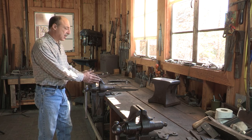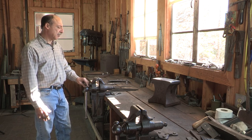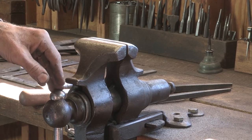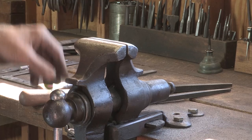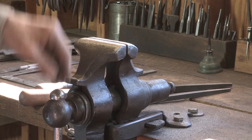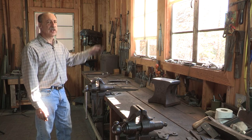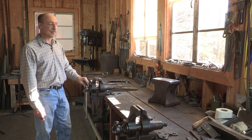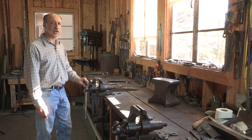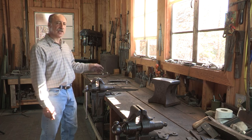I've got the vice set up to take advantage of all that incoming light from the windows. Many historic shops are set up so that the windows face north, which gives you the most even light through the course of the day. I wasn't able to do that here — my windows face south, which often gives me too much light, so I need shades on the windows at some times of the year or day to keep direct light off the vice and bench. But north-facing windows are really ideal.